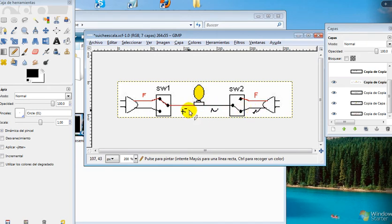Now somebody moved switch number one — the bulb is on because the bulb is between phase and neutral, 120V, so the bulb is on. This way of wiring the three-way switch is a little risky. It's not recommended — there is another way to wire this type of switch.